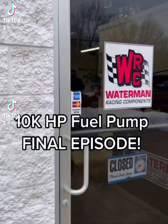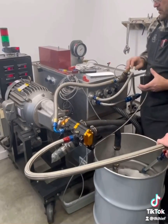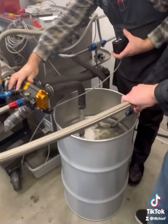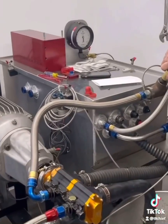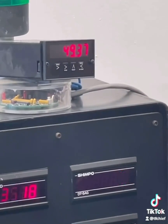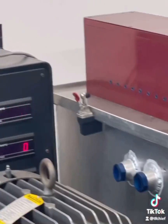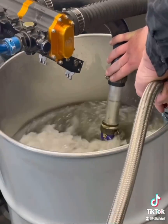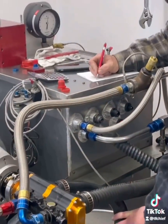Today I'm here at Waterman's in Brownsburg, Indiana, and this is the flow bench we're going to use today. We start by just running it up, making sure we don't have any issues. We flow this pump one half at a time — one will be recirculating in this barrel, the other half goes through the flow meter and returns to the tank underneath the bench. This section of the pump was about 49.5 gallons at 3,500 pump speed, which calculates out to 7,000 RPM of the motor. We'll do the same thing with the other section, then pour some pressure on it and see how much flow rate loss we have.